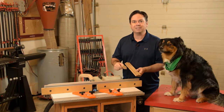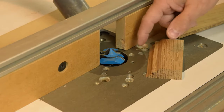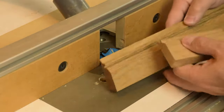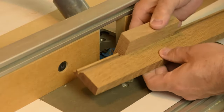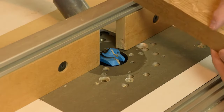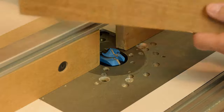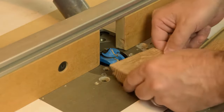This is what the locking miter bit looks like — router table is unplugged here. The resulting joint is a really neat interlocking one that fits together without much fuss, and on the show side you can get a nice tight miter that can actually be burnished over with a screwdriver, so it's easy to glue and easy to fit.